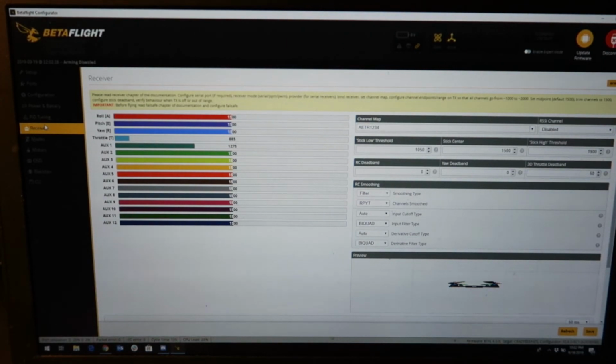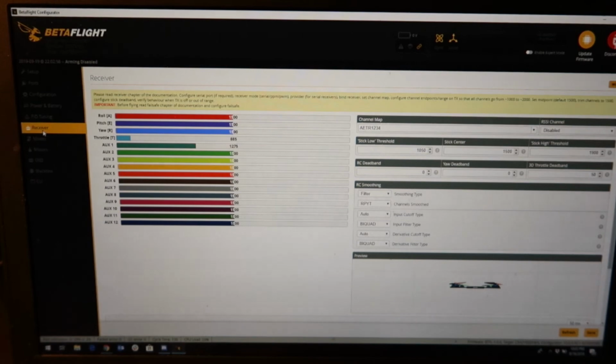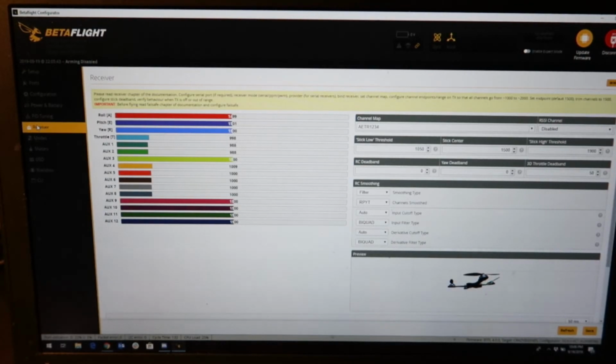and I obviously don't, so I need to go ahead and make sure I get the RX and the TX wires swapped around because I have this habit. It's like almost 100% I can always get them wrong despite my best efforts. And just like that, through the magic of editing, I've gone ahead and swapped the RX and TX lines, and every channel is in its appropriate place. Even have the aux channels going, got my aux channel 1 and 2 there. But now we are ready to set up the modes here.